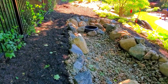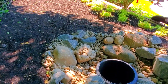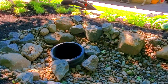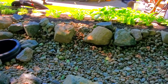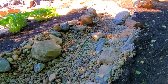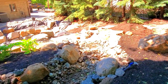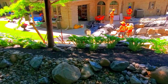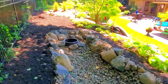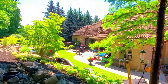So we've got about a 30-foot upwell wetland, our vault here. This is sewer pipe put in place and perforated across the bottom. It's about 3 feet deep, 3 feet of stone, various sizes, and we'll get our plants in up to that. So more or less a hidden system up top here, but it was really just a plateau with an empty lawn space not being used up behind the sort of living space of the backyard over that way.